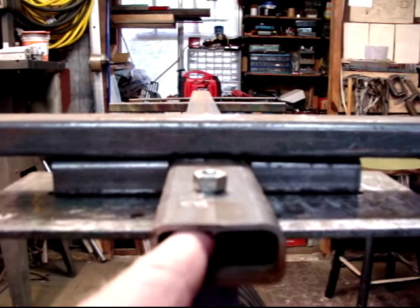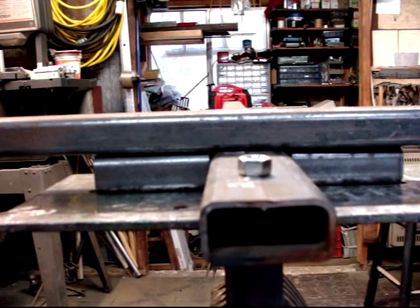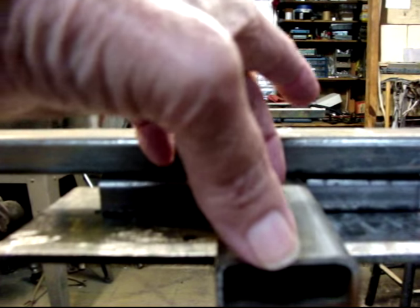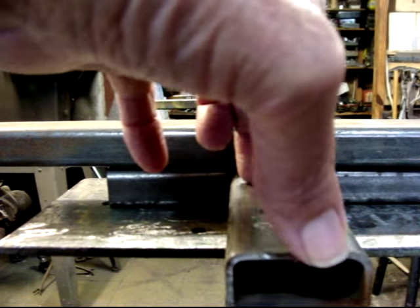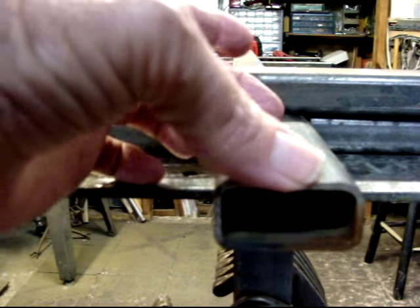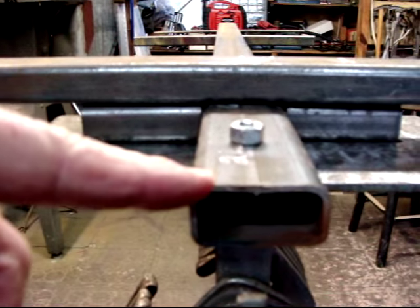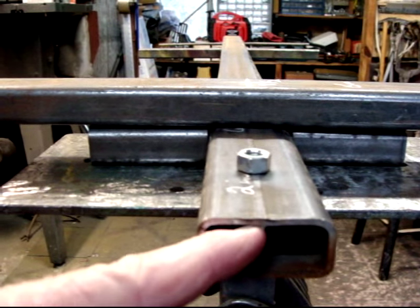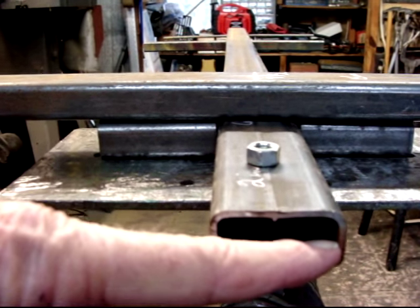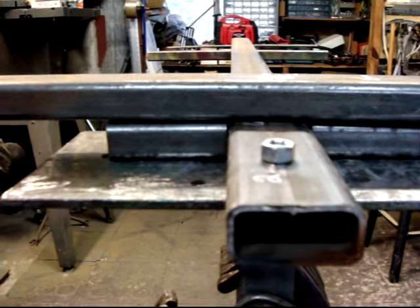That has to be filed out — that little hang-down thing there. The seam has to be filed out past the coupler so that when the coupler moves inside of this it doesn't bind up. That does happen, so that's the only problem with using this tubing. Sometimes if you find a piece where that tab is on the inside over on this side, it makes a whole lot less trouble. You're going to need a good file and it will take you a while to file that out.